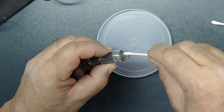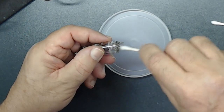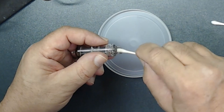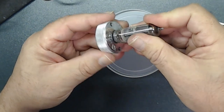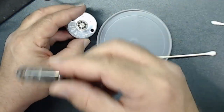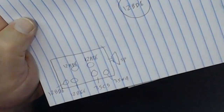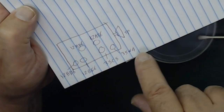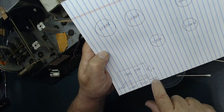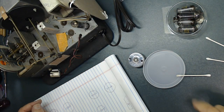Make sure both sides are clean — I spend some time cleaning these. You do not want to use sandpaper or anything like that — you'll mess them up. That's the best way I know to clean them. Make sure it's nice and straight, then it's ready to be installed. This one I wrote on it '35W4' — that's why I documented it here. The 35W4 goes right here near the speaker. You just put it right here and press it down — it's set. We use the same technique for the rest of the tubes.